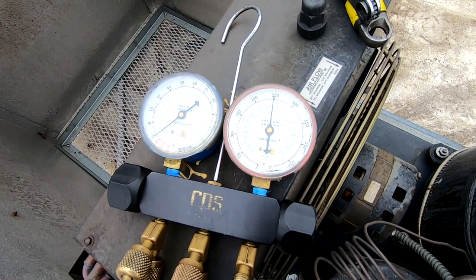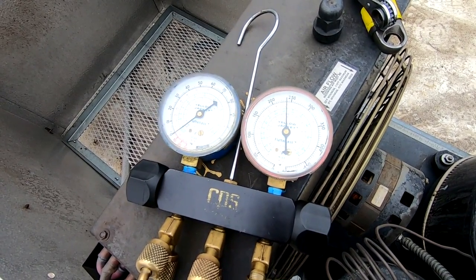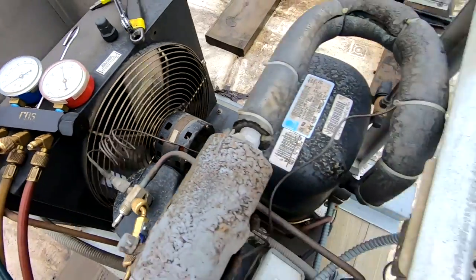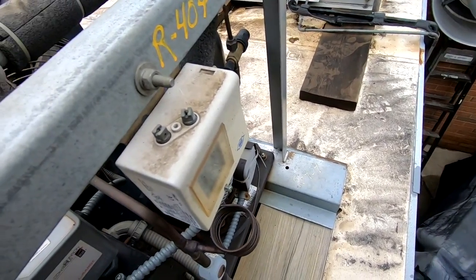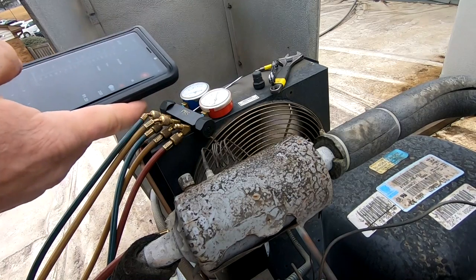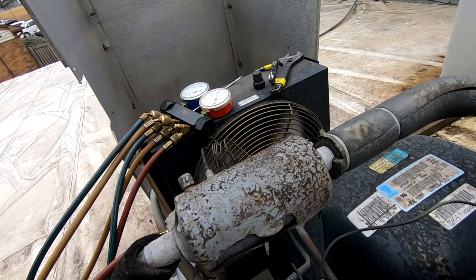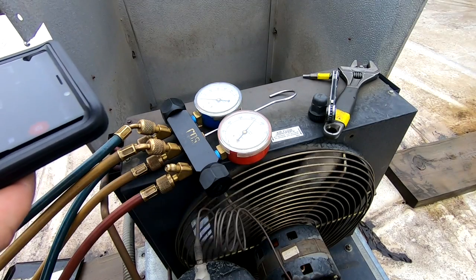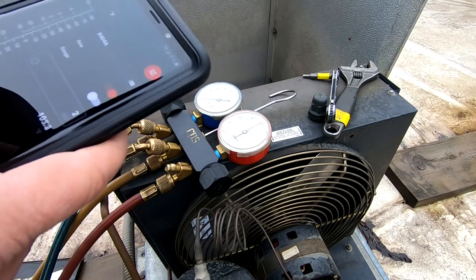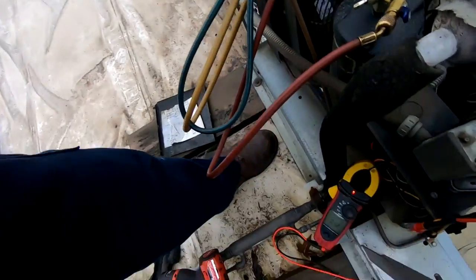Keep an eye on our sight glass to see if we're bubbling out. Just raised up from a cut-out at 250 psi — comes in about 105 degrees now. Cuts off about 200 psi. A little sooner than that actually — put a little more differential in it. 200 psi is about 90 degrees — I'd like that out of there, I don't usually like it below 90 degrees. So 255 psi is 105 degrees saturation; it shut off at about 210, which would be about 92 degrees — that's actually a little better.